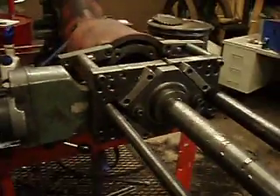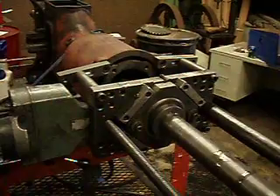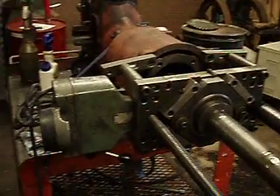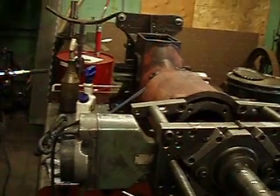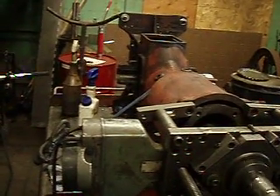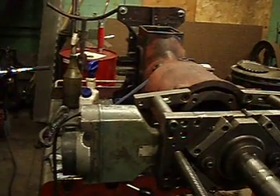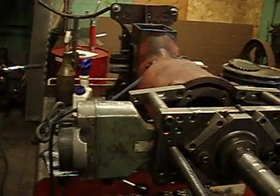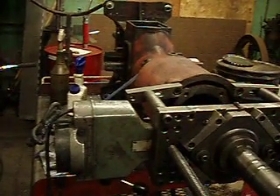What we got here is a home-built hydraulic driven boring bar. We're lined up. We got a bearing bracket on each end of the machine, a little adaptation to get everything to bolt. We're in the process of boring this out. We'll bore the inside of the motor out to accept the sleeve. We'll put the sleeve in and then we'll bore the sleeve to the piston size.